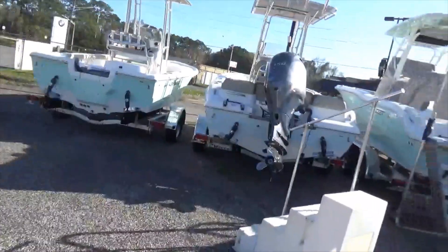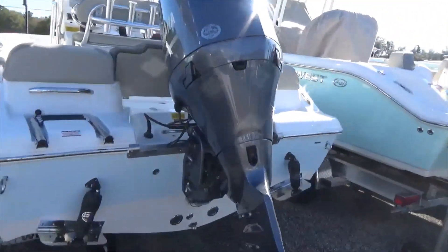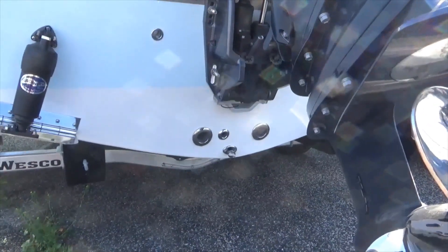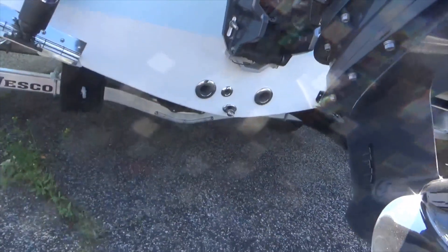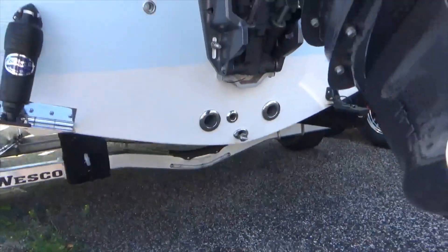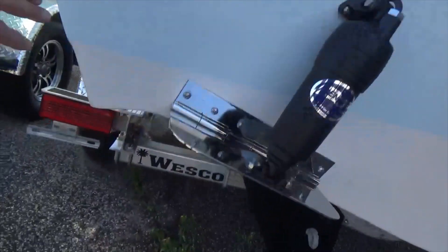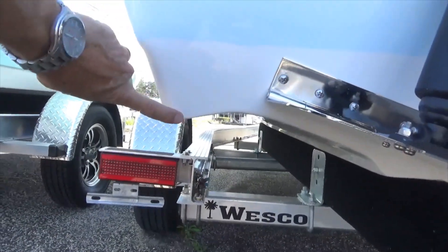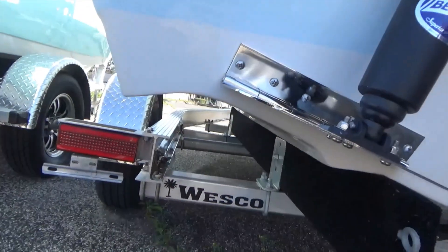Let's move over to this 18 Key West. This is running at about 20 degrees of dead rise — a little more dead rise, a very typical bottom configuration on this boat. Very smooth running, very easy to propel, just a very good all-around boat. Back here at the chine you can really get a sense of the reverse in the chine — it comes down and then angles downward, throwing the spray down before it goes out. Very important feature.